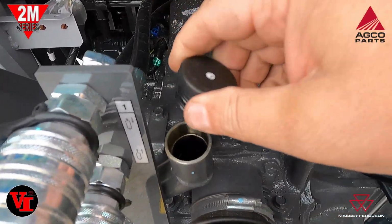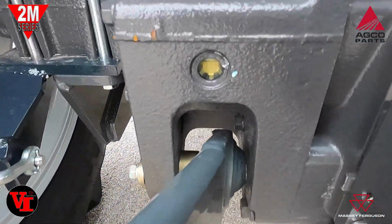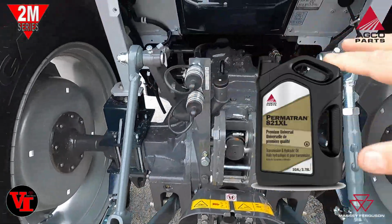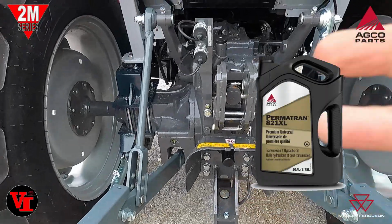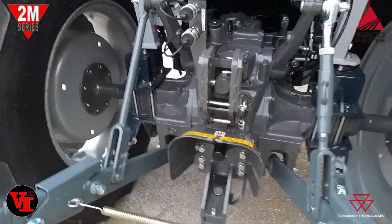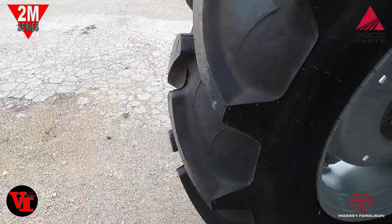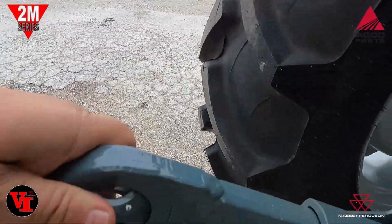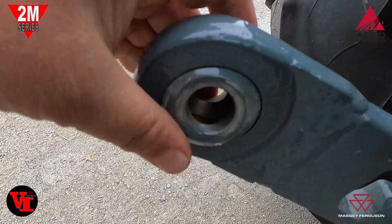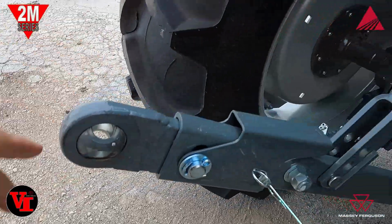That's your hydraulic oil fill. And with our sight glass right down there for hydraulic transmission, rear end, all through that loop. So you got three places you got lubricant: front axle, engine, and rear end. You got telescopic stabilizers there with cross drilled pins. You got cat 1, cat 2 on the same hitch ball.